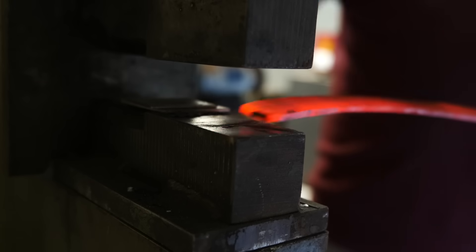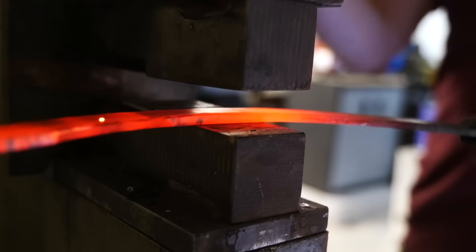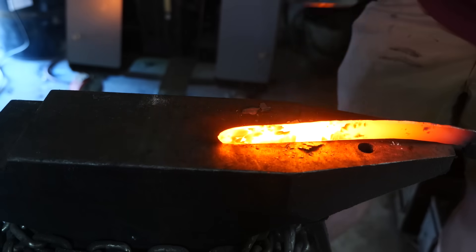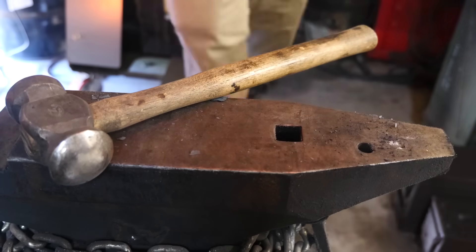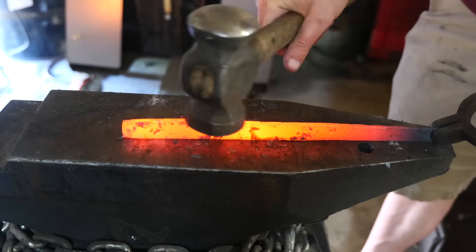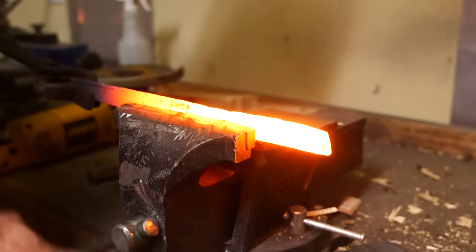For every hour or two at high temperatures, we should diffuse carbon about a half a millimeter to one and a half millimeters into the steel. Lots of things affect the penetration of carbon, such as the alloy composition, so this may or may not work very well. After we get enough carbon into the outer part of our ice skate blade, we can cut, stack, and forge weld things, drawing it out multiple times to help homogenize that carbon throughout our piece of metal.